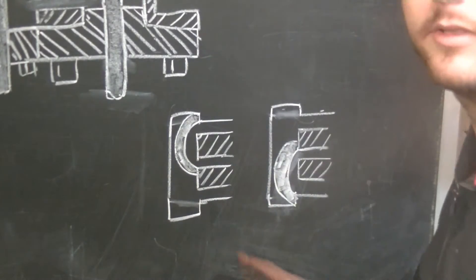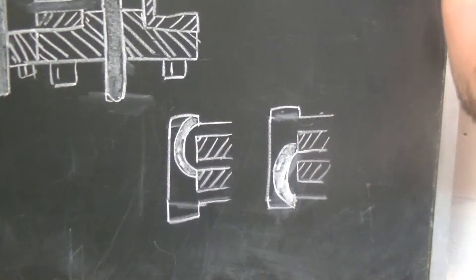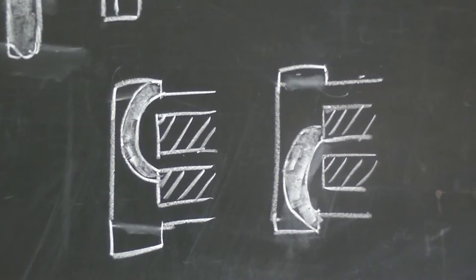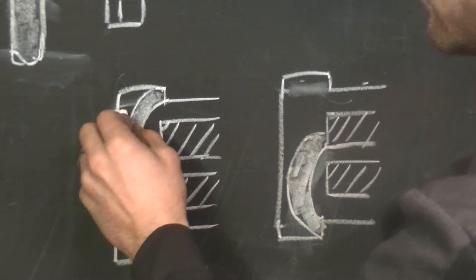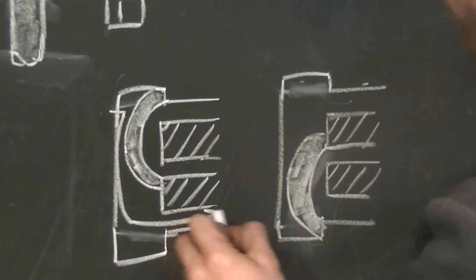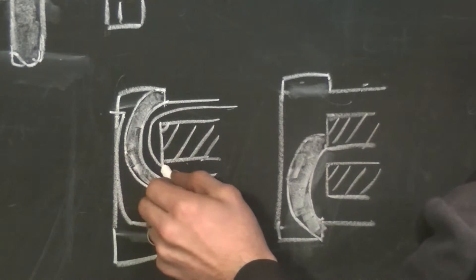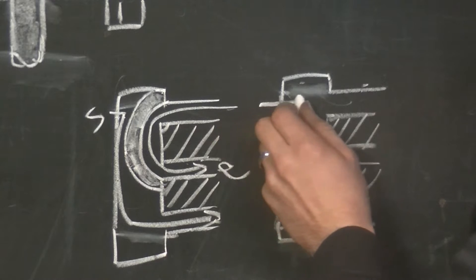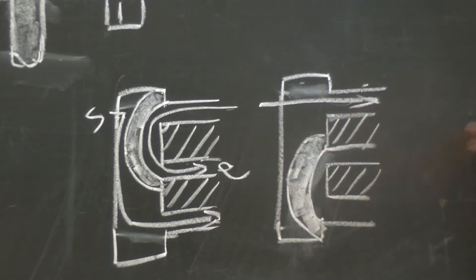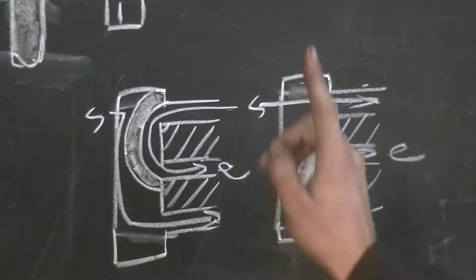Here are a couple of quick sketches to illustrate. The C shape is the slide valve. In the first position, with outside admission, steam comes in on the outside of the slide valve and goes to the bottom, while the piston pushes exhaust out the top exhaust port. As the engine moves, the C shifts downward — now steam goes into the top port and the piston pushes exhaust out the bottom. It just moves up and down, switching steam between top and bottom.